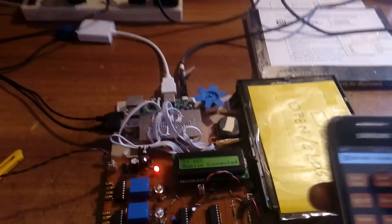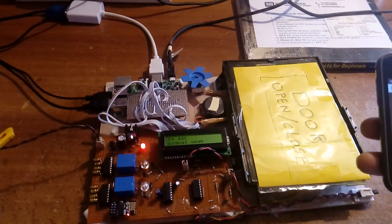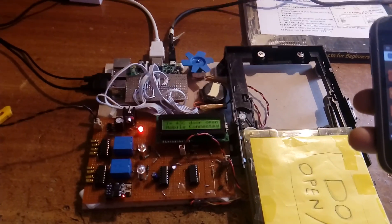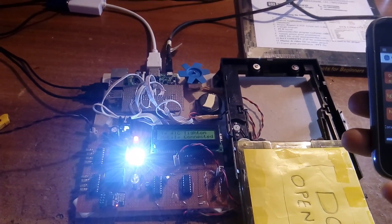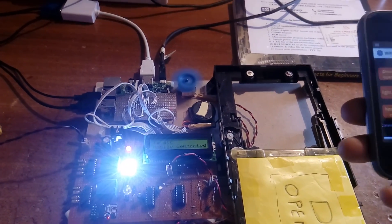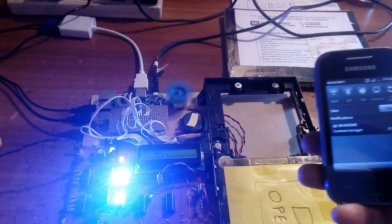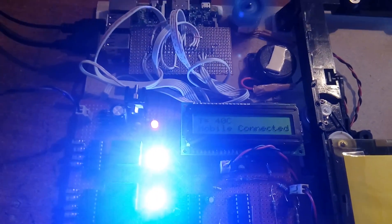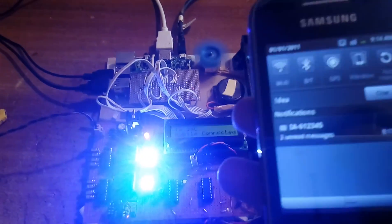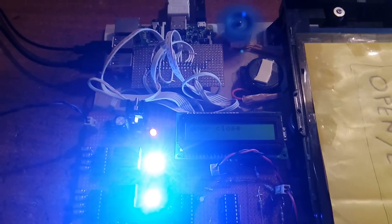At 63 degrees, 'over temperature' is displayed and the alarm is activated. Then all off is pressed. Suppose the owner is going outside in a hurry — door open, light on, fan on, heater on are all active. When the owner disconnects Wi-Fi, after 4 to 5 seconds the system counts whether the mobile is near the area. If the mobile is more than 5 meters away and signal is weak, after 5 counts it determines the owner has left and turns everything off automatically.